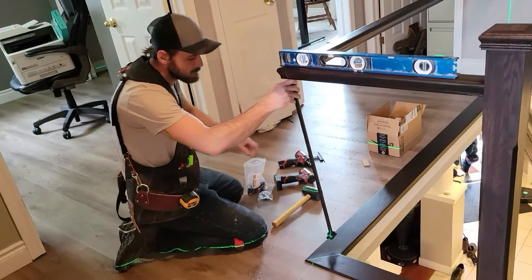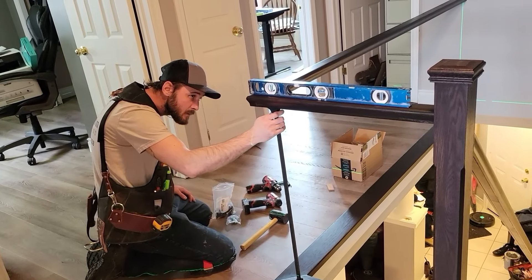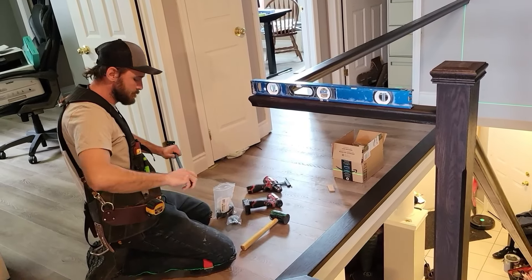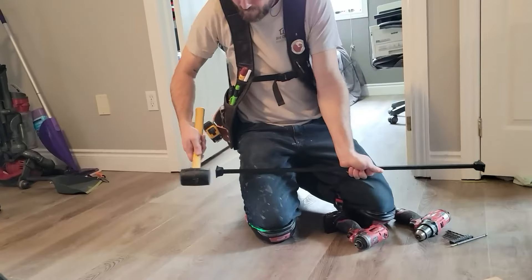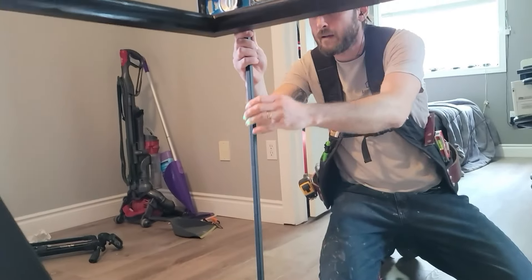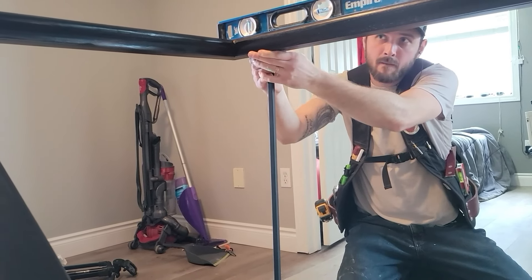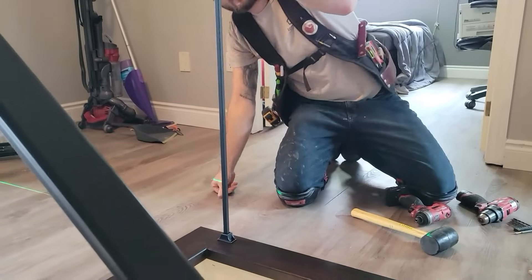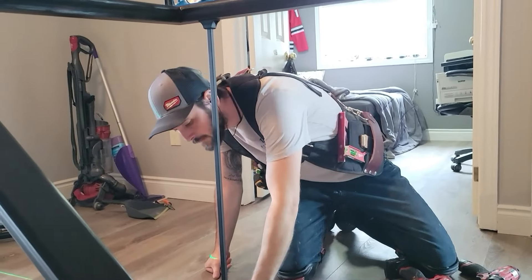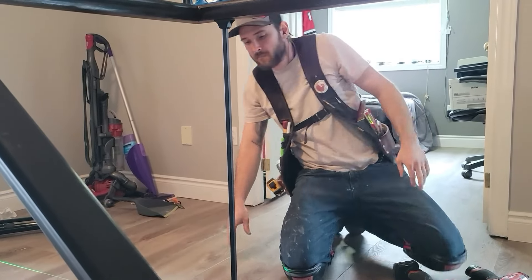The rubber mallet makes sure we don't have any damage. Then we're going to use those lasers to line ourselves up. Getting that set into place — you might have to do slight adjustments on how much you hit those shoes on. In this case we needed to do it a little bit more. This is a finicky job. We have to make sure that we are patient as we go along. You can see we have that level in place, making sure it is at exact height. The first one is always the most finicky — it always takes the most amount of time. But it is the most important for the rest of the job. If you get that right, then you're going to be golden.